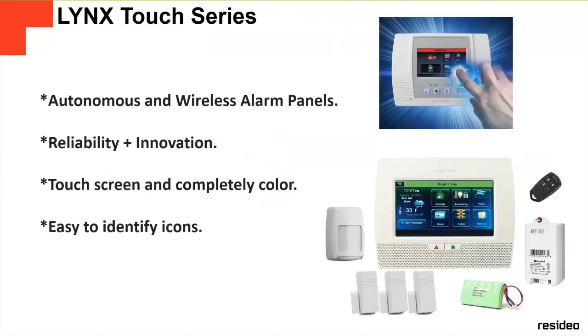The Lynx Touch series is an autonomous and wireless alarm panel, 100% wireless. Well, we say 100%, but actually they have only one wired zone, zone number one. That's the only one. Everything else is wireless. And they all work with Honeywell wireless devices, the 5800 series. It won't work with any other wireless devices for security, any other brands, only Honeywell. It's reliable and full of innovation.